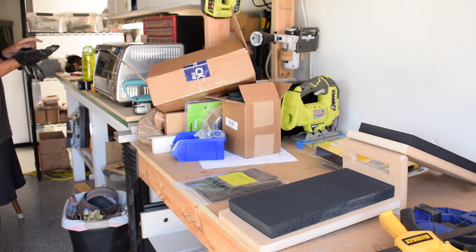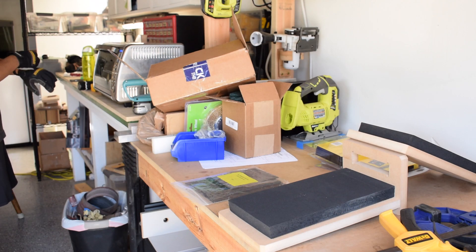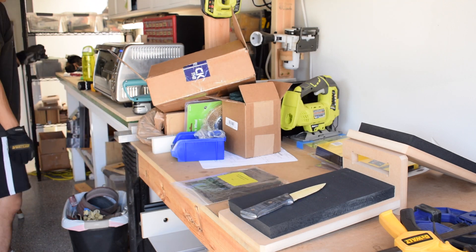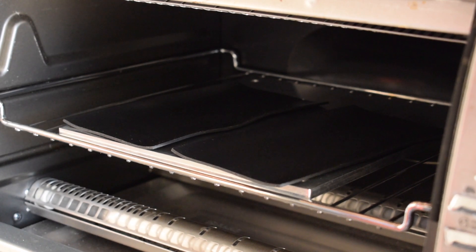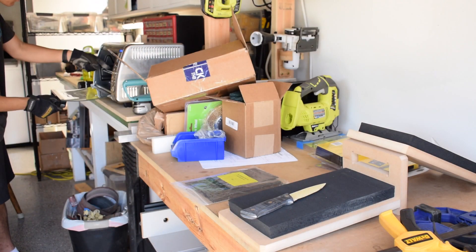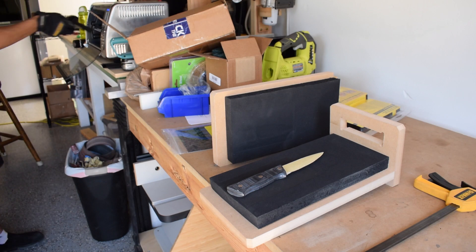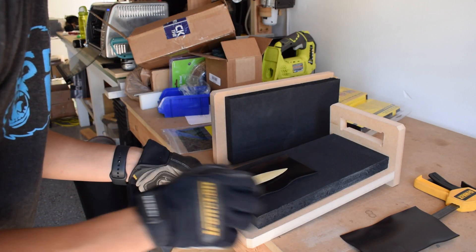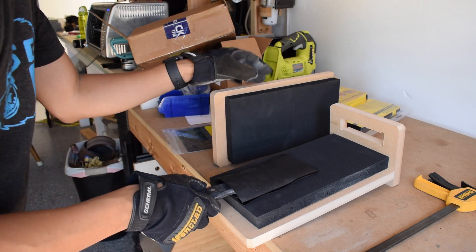The first method I'm using to make my sheath is the simplest. I start by heating up two pieces of Kydex, a thermoplastic commonly used for applications like this. I'm heating it in my oven at about 340 degrees Fahrenheit or about 170°C on top of a scrap sheet of aluminum. If you do this directly on the grate, you can get uneven heating, potentially transferring marks into your sheet, and you also risk the Kydex drooping down into your heating element if you let it sit too long. The aluminum plate helps conduct heat quickly and evenly into your Kydex.